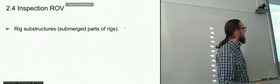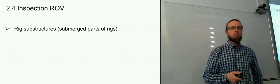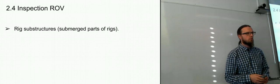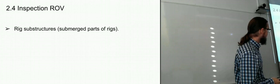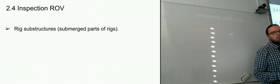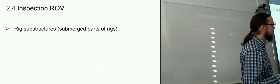Sometimes you need more than a visual inspection — maybe it has uncovered something requiring specialized equipment like an ultrasound to look for cracks in the material, or magnetic particle testing. You may have done that in your materials course lab with NDT — non-destructive testing methods. The only one you basically didn't do was the x-ray one, which is the dangerous one.